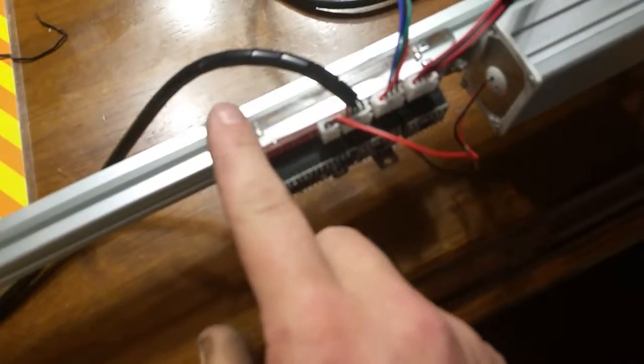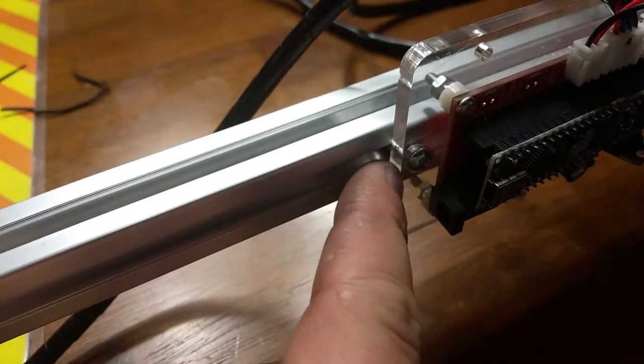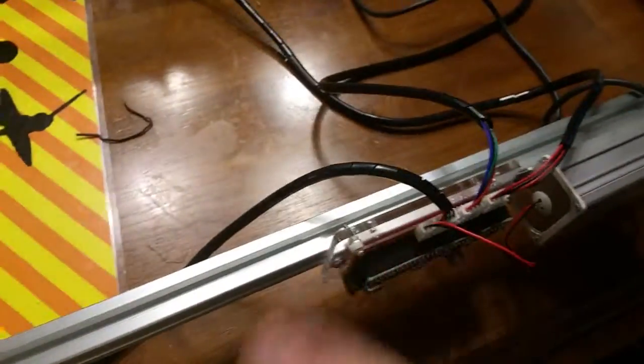The thing you really need to pay attention to: when building the frame, before you buckle it down, go ahead and put the bolts in. This works like a t-track — you put a nut in at the end, slide it down, and put a bolt in to tighten the nut. You need four: one here, one here, one here, and one here. Otherwise you'll have to pop the side off and redo it like I did.